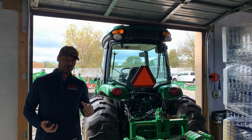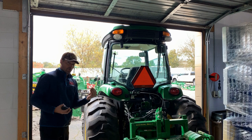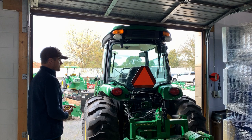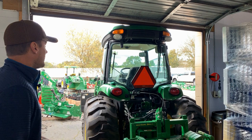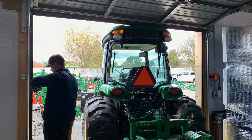That was done by loading these tires with liquid ballast. I am not a tire expert, but I rely on tire experts. I've been told that when you load these tires with liquid ballast, you are going to lower that air pressure slightly, which cushions the ride a little more, makes it more stable and comfortable, less bouncy and swish-washy. That's just a benefit if you're looking to save a little bit of height — before I did that, the cab was pushed up all the way and I was just barely rubbing the bottom edge of the trim. An eighth of an inch more and it wasn't happening. Now it's just barely touching the bottom of that weatherstripping, which I'm used to — my F-250 and F-350 back at my home garage do the same thing. So I'm going to measure this opening for you.